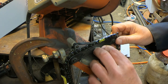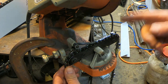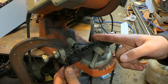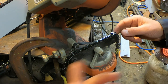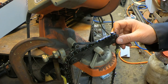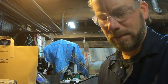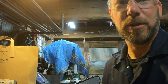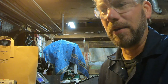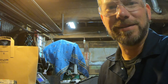I can pull my skin across it and it's super catchy — it's catching on the little lines of your fingers, which means it's a good sharp edge. We're going to do this with all the teeth on this angle, then reset the sharpener to do the other side. Once all teeth are sharpened, we'll go through and cut off two of every other two cutting teeth so they become clearing teeth, giving a much smoother cut when ripping logs with the Alaskan sawmill.